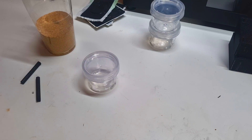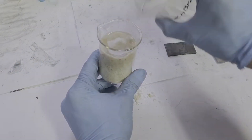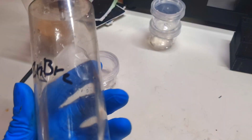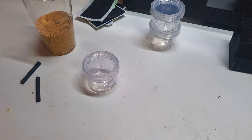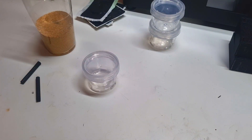In this first video I will make a battery based on one I made around one year ago. I got some questions asking if a zinc-iodine battery can be made. The battery I made one year ago was a zinc-bromine sand battery. Now the question is: instead of zinc-bromine, can I make a zinc-iodine sand battery? Yes I can — the only thing I need to replace is the electrolyte: instead of zinc bromide, I'll use zinc iodide.